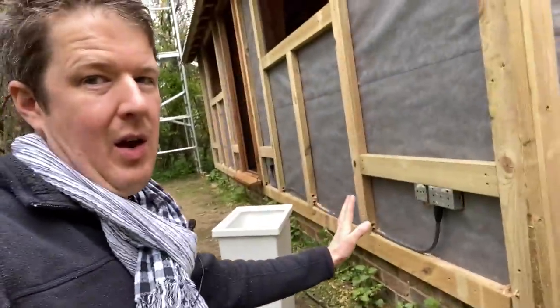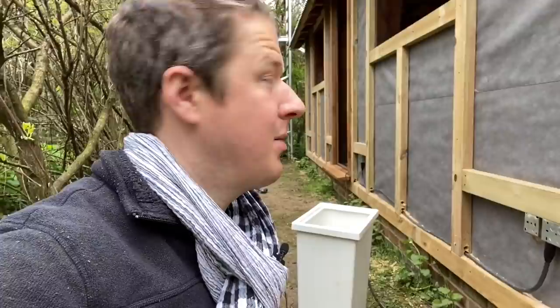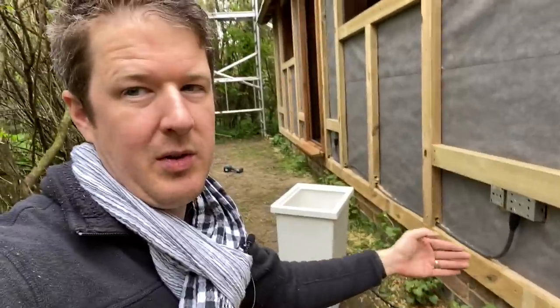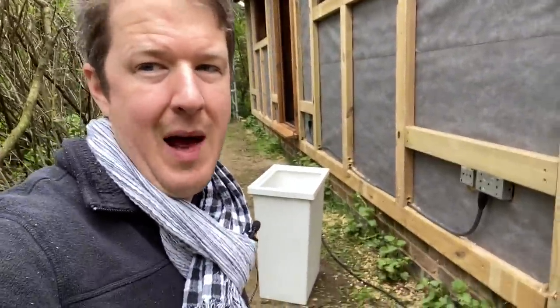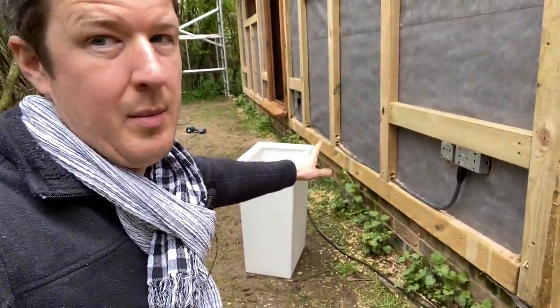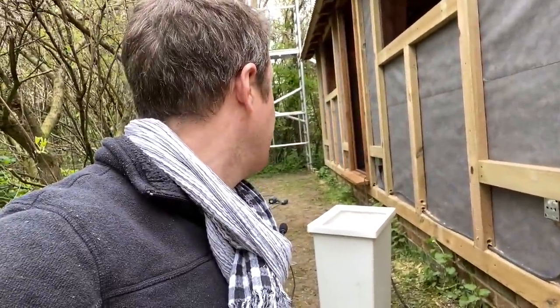There is going to be insulation going in over this, so it's 4mm SWA, and I'm just going to do 20 amp radials, so cable carrying capacity should be fine. I'm going to have it pressed up against the ply on the other side as much as possible, so that can dissipate a little bit of the heat forward from the insulation. It's that kind of Kingspan stuff, you know, the hard stuff that's going to go in there. So they're just going to notch out the corners at the bottom, put the insulation in, and then it's going to be feather edge boarding going in all the way around. I think oak feather edge boarding, which will be nice.